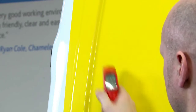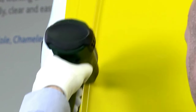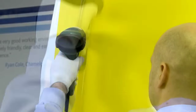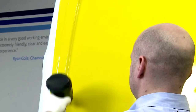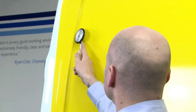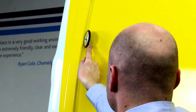The same post-heating steps need to be applied. The difference between this film and IJ380 is that the minimum post-heating temperature needs to be at least 100°C as opposed to 80°C. This applies to any wrapping film with Comply adhesive technology. Post-heating is critical — you are effectively recasting the vinyl to its new shape, but also enabling the adhesive to flow and achieve maximum bond immediately. Use the small roller to ensure the film is properly applied into the valley of the recess.